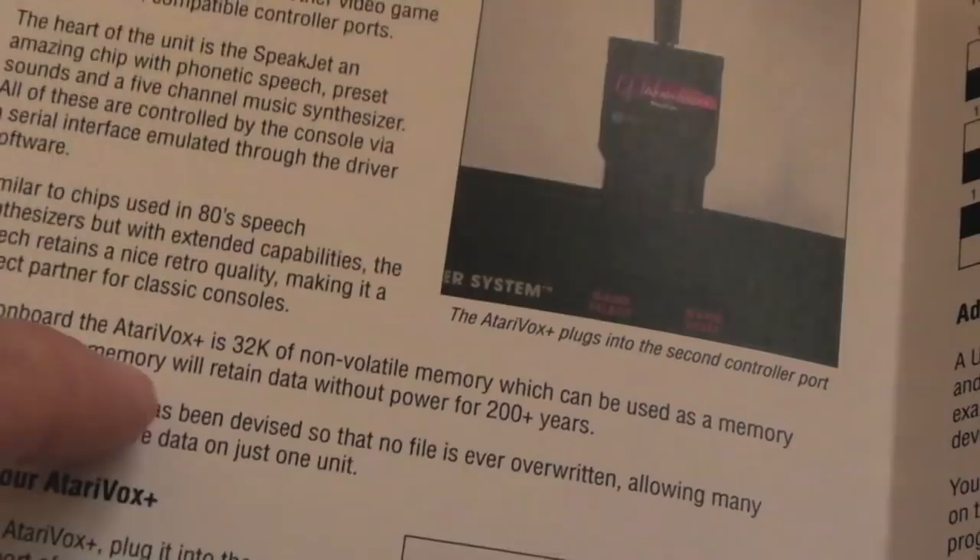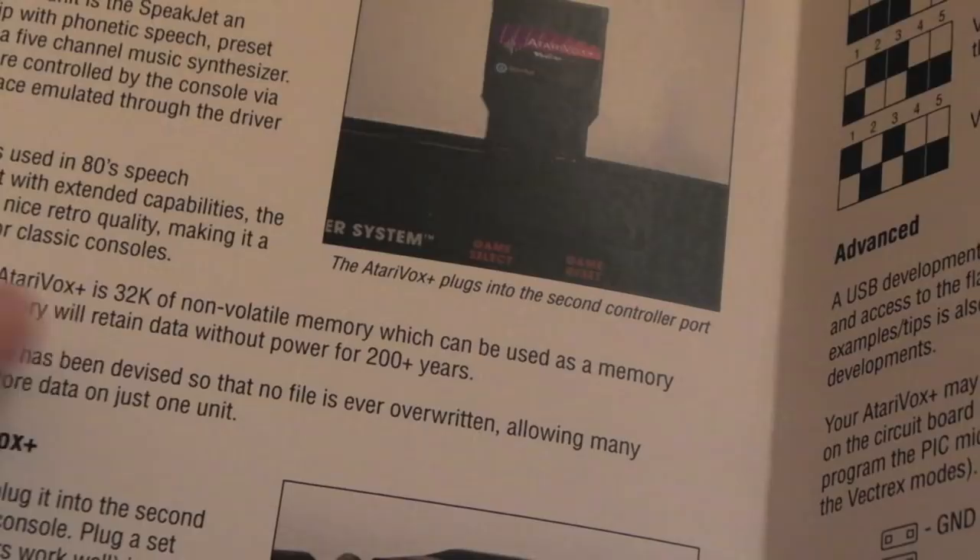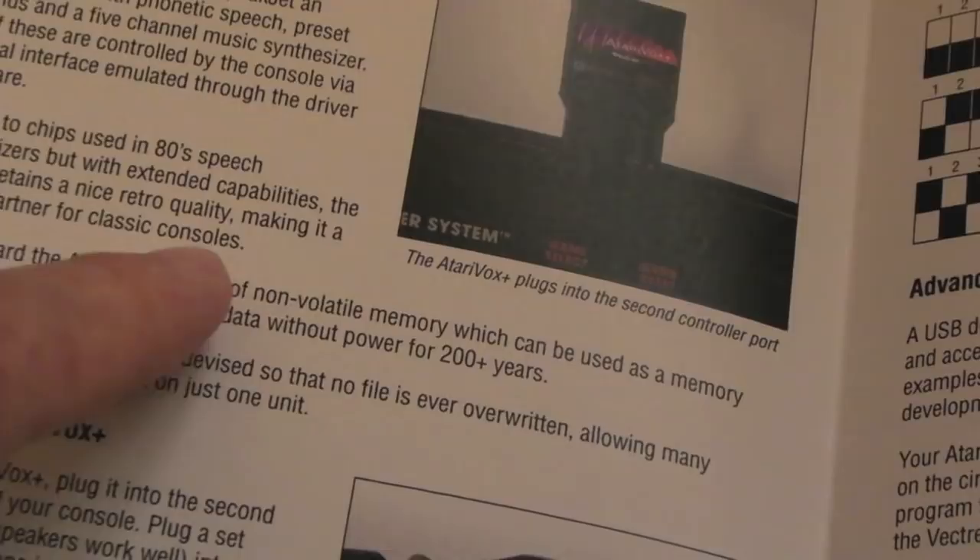You need to think about how you wire that into certain systems. I'm just testing the serial port here — I'm not sure whether we'd have sufficient connections on the serial port to also connect the non-volatile side. On the MAX232 chip you can, but on an ST serial port or an Amiga serial port I'm not sure.